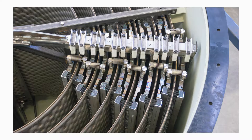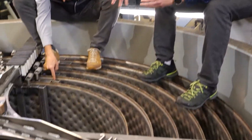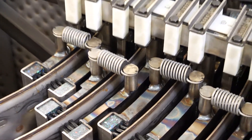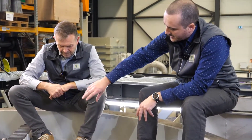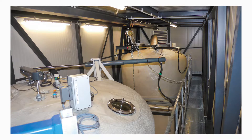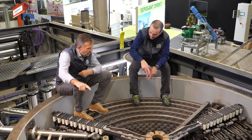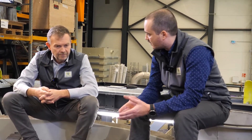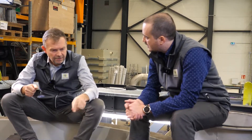Is there a need to clean them from time to time? Yes, of course — because everybody knows if you put milk on a heating plate it will stick there. So we have invented this system: a brushing system for the heating plates. These brushes are held by springs and pressed onto the surface, and then a hydraulic system from outside the evaporator moves it 120 degrees. Because of these three arms, the whole plates are cleaned and every time you have a perfect heat transfer from the substrate to the heat exchanger plates.